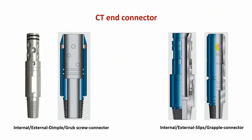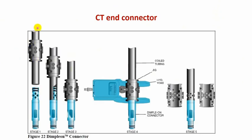Coil tube is inserted inside it, and it can be pulled back due to slips action, and here also slips action. And this type, as you can see from this tool, this gray is the coil tube. It's inserted around the connector. Then this tool, as you can see from there, it's two halves, is inserted around, and these screws are made by this tool, hydraulic yoke, to make impressions in the OD of coil tube to match the impressions already graved here.